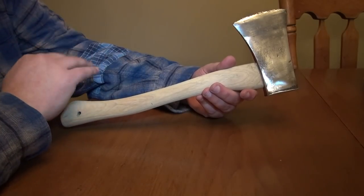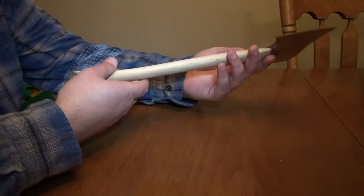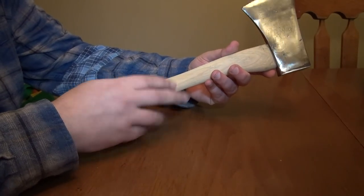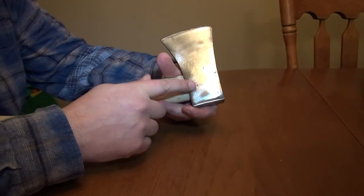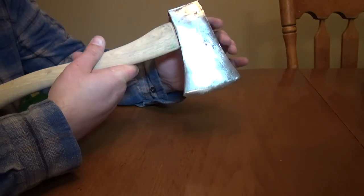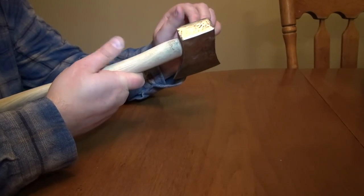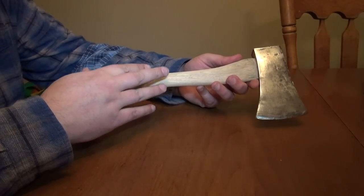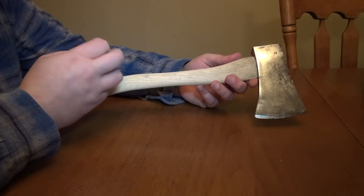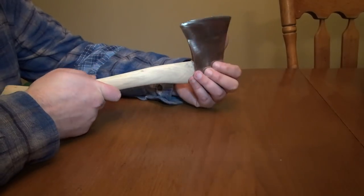Giving the handle a light sanding. Looks excellent — a couple of little spots of damage and a few little dents at the bottom, but otherwise very nice handle. There's a minor split down there but otherwise excellent condition, which is what I wanted to see. Did a very quick buff on the head, looking for major issues — any cracks or splits that would make you want to discard it. No issues. Quickly rounded over the edge of the poles, because that's a durability concern where it was starting to split and fracture. The next step is to apply some coats of linseed oil and get the handle back in working condition — coat it every couple of days until it doesn't show that really rapid dry soak, indicating the wood is nice and lubricated.